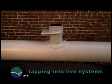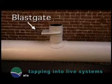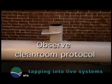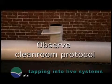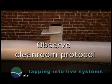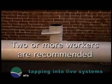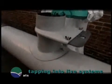This operation requires a blast gate or damper with blade seals installed in the tap. Be sure to observe the required clean room protocol for cleanliness before performing the following procedure. The immediate area of the live tap operation may have to be temporarily closed off with plastic to contain particles. For this operation, two or more workers are recommended.